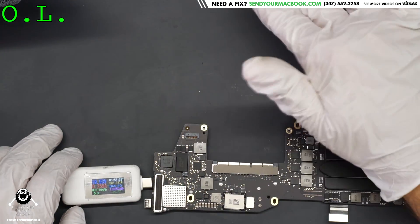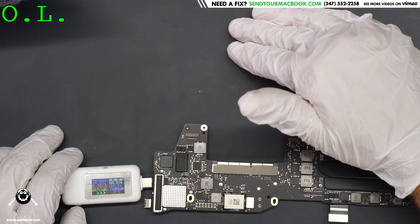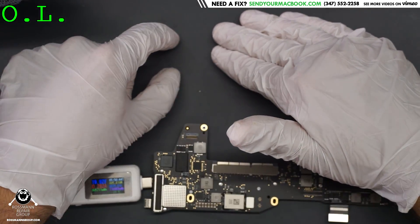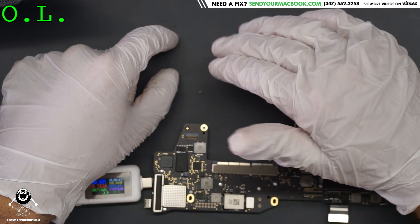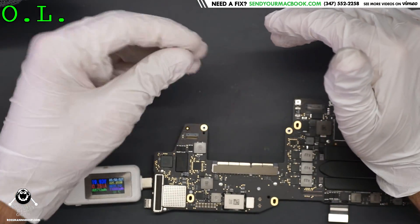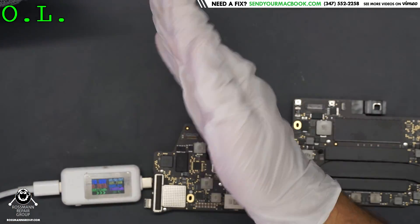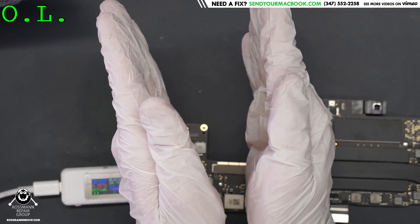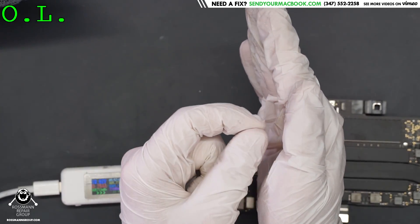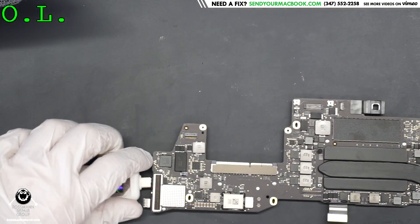What you do is remove it the way I showed you. Once it's removed, you wick the pads, you have solder on one pad, the other one's flat. Because your iron can only heat one pad at a time, you heat that one pad you put solder on, slide the capacitor in while pushing it flat on the board. Then you solder the other side and it will be nice and flat. Because if you have solder on both pads and solder one at a time, you wind up with the cap sitting like a wedge between the cap and the board - there's a big gap - and it's easier for it to pry off or break off. You don't want that to happen.